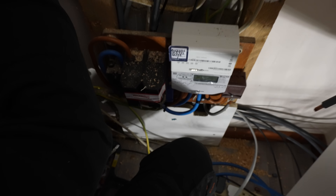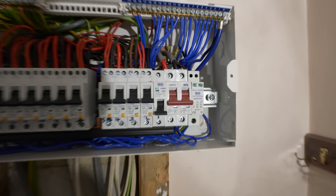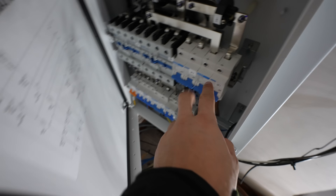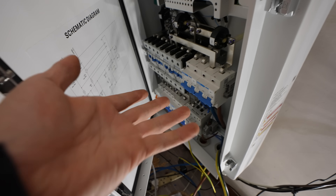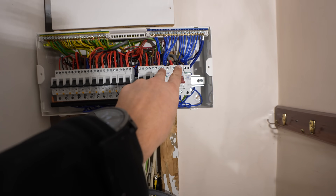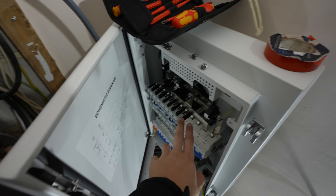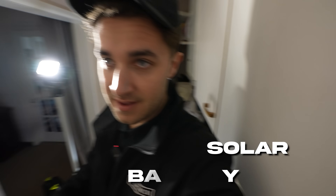As we discussed earlier, the power comes into the building through the main head, through the meter and up into the main switch. We want tails out of that meter into here — this is the input for our gateway or ATS. The house load comes off of that back up into this, and then we'll have all the separate wiring to do afterwards. So the house load is on an uninterruptible supply — whether that be generator, batteries, or solar — all managed by this smart gateway.